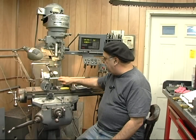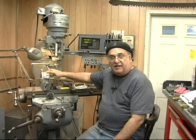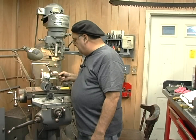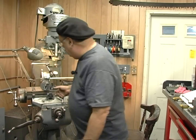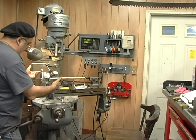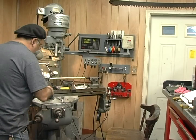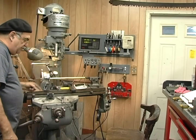So what we're going to do is cut the grooves down here. This is a rotary table with an indexing plate on it. There are 45 notches around the thing. So 45 divided into 360 - this isn't rocket science - comes out to 8 degrees. On this particular plate, you have to calculate to get the right plate and there's a whole formula for that, but I didn't need all that. Two cuts, back in the same hole, 8 degrees. So 8 degrees all the way around.